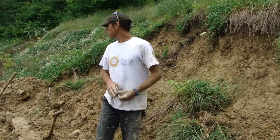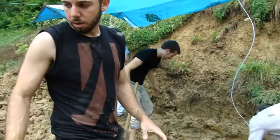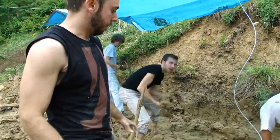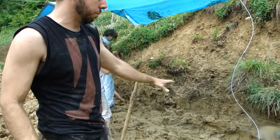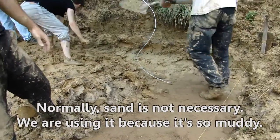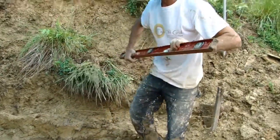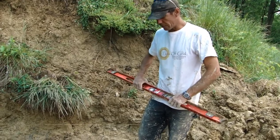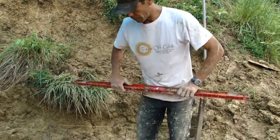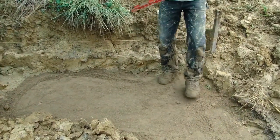It's easier to do when we have dry dirt, but we do have some dry piles and gravel which compacts pretty well. So we have our orientation all laid out with string lines, and now we're leveling out the area where the tire work is going to go — getting it basically level just with the dirt that's here, then laying sand over that for a nice compact flat surface to lay the tires on. I'm putting a layer of sand down over the clay-wet situation to get a nice level base for our first course of tires, and I'm about ready to lay out the first corner right now.